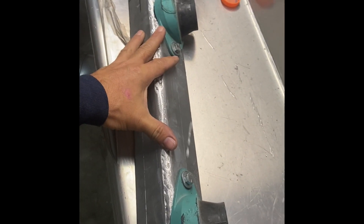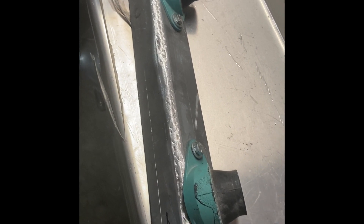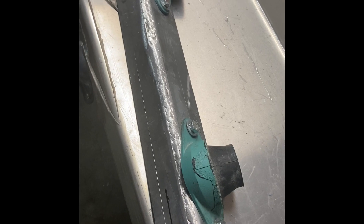To simplify things, I took one of those axes out of the equation. I created a rail for both mounts to bolt to, and I'm just going to use big three-eighths bolts going right through the sides of those engine bearers — so you're using the shear strength of those three-eighths bolts.